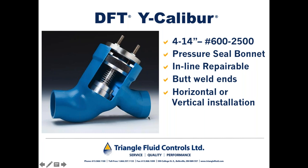Typical applications for this check valve, again, are high pressure applications in the power industry, where we have a lot of class 1500 applications and above. It's also utilized in the oil and gas industry on the discharge of high pressure boiler feed water pumps, also used on the discharge of DEA, or again, lean amine booster pumps. Again, very critical service applications where end users are very dependent on this check valve and expect them to operate properly over a long period of time.